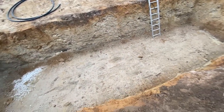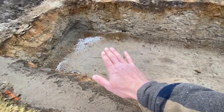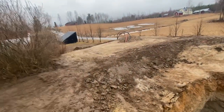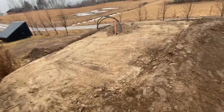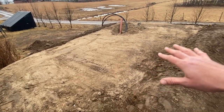Once I've done that I'm going to put 70mm insulation outside of the wall and use 100mm insulation foam boards on the whole base here. I've got to get in touch with the company putting together the Adderfels house for us - they're using ground pins that drive into the ground, high torque ones that need a special machine to put in.